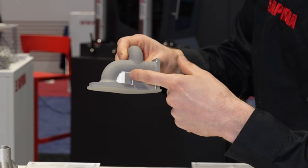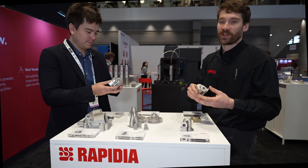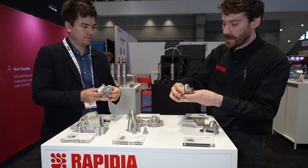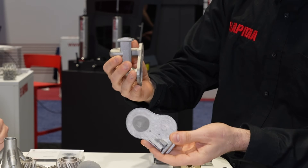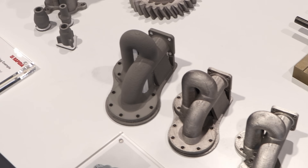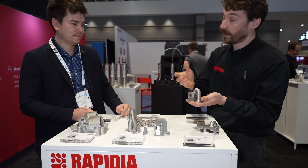Part of the support are these metal parts, because in sintering the stiffness of metal is about like warm plasticine — it's almost at its melting point, so it's really soft. Normally something like this would just sag under gravity. So we put those metal pieces in with it, and they shrink with the whole thing at the same rate and support it all the way through the shrinkage. Afterwards you have your raft with the metal tower still attached, and all the white area is gone. The white area also acts as a release layer — without separation, the raft and part would basically weld together at those temperatures, but it has a little bit of ceramic powder that prevents bonding.